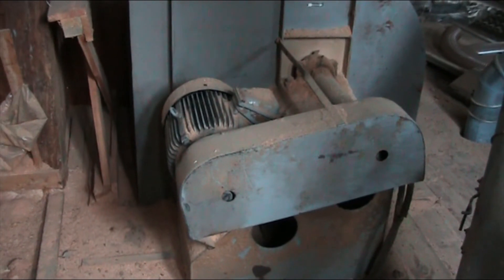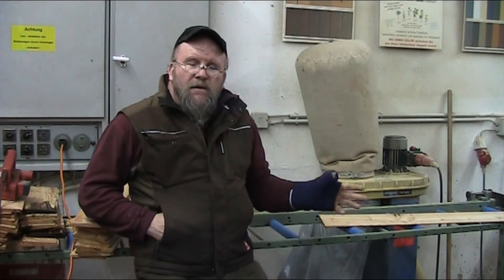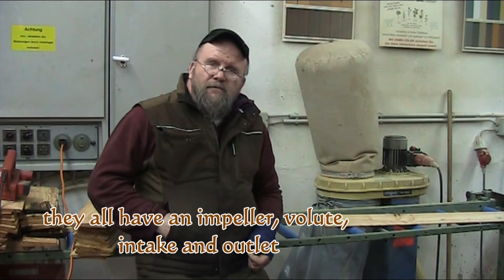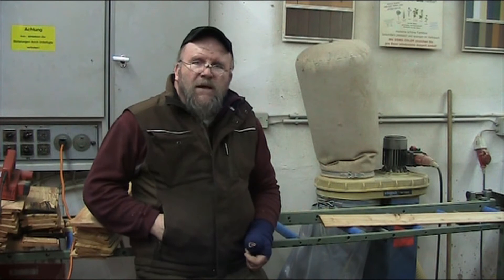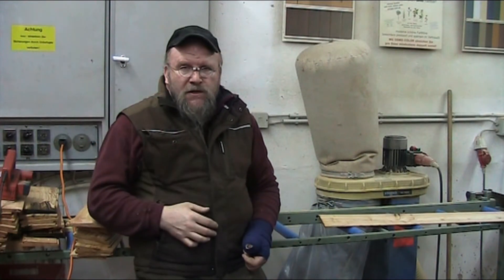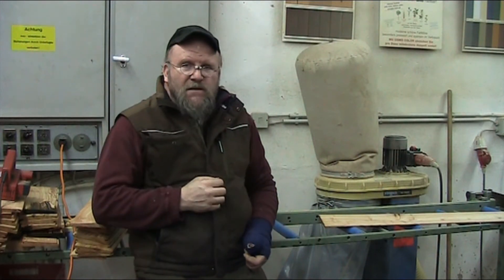The motor spins a little faster than the shaft of the impeller. What separates these units from the larger ones I just showed you is not so much the configuration — they're pretty well universal. There's a volute, there's an impeller, and of course the pipes. These things are designed to move air and also material. In the larger units you have a closed-faced impeller, and in these smaller ones you have an open-faced impeller.